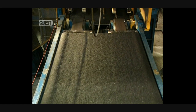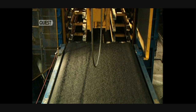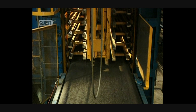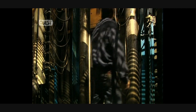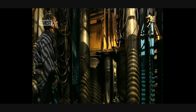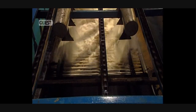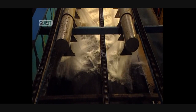The powder is spread out on these enormous moulds. It's seven metres long and just over a metre wide. They are then stored in this loading magazine of the press. Once full, the moulds are sent to the rubber mat press. Within this mat press, the powder has to be cooked at high temperatures for 30 minutes. The cooked mat goes through the unmoulding unit before being sent off to cool.